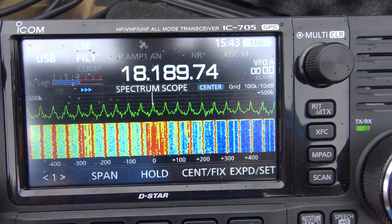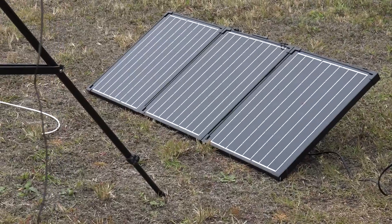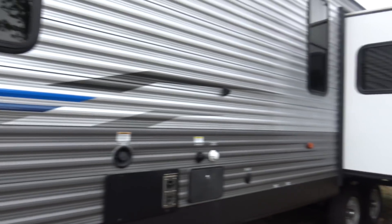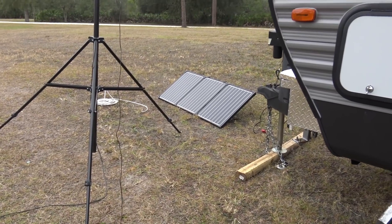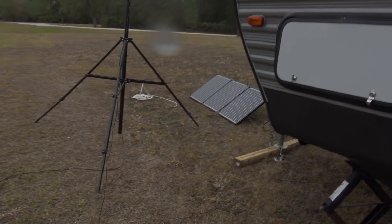17 meters is now useless. So yes, the solar does make a substantial increase in noise. This solar charge controller here is not connected — it's the big one I'll show on the other channel about the RV solar setup. Anyway, I've got to do something about that or just move my antennas further away. 73, KJ4YZI.